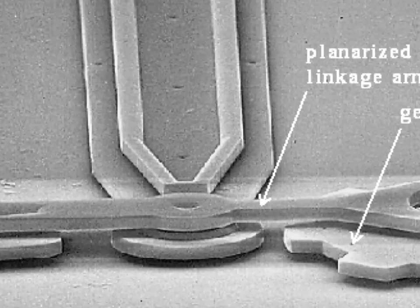The topography problem also affects photolithography: if you're imaging very small structures with a depth of focus less than a micron, and the surface has bumps going two to three tenths of a micron up and down, some places will be in focus and others will be way out of focus, creating line width variations. So they developed methods to flatten the surface — and that's what CMP is for.